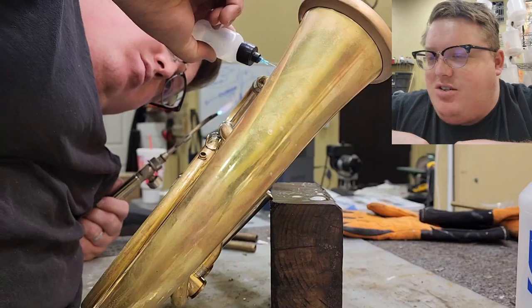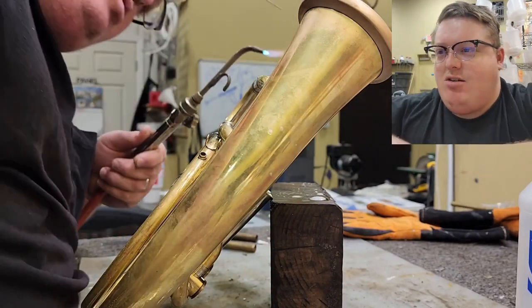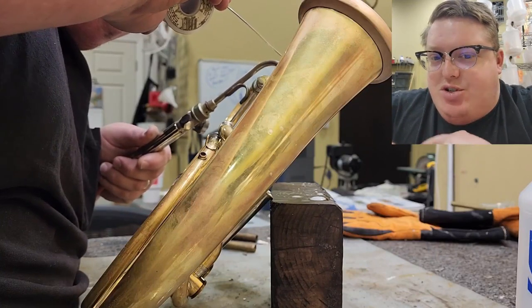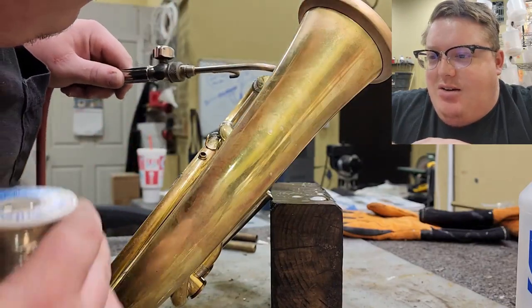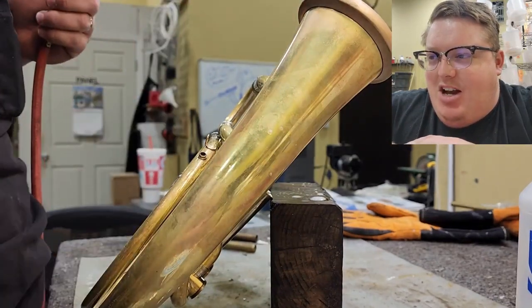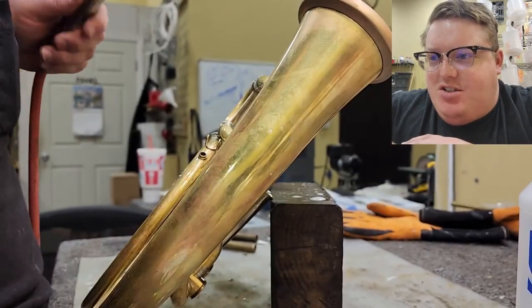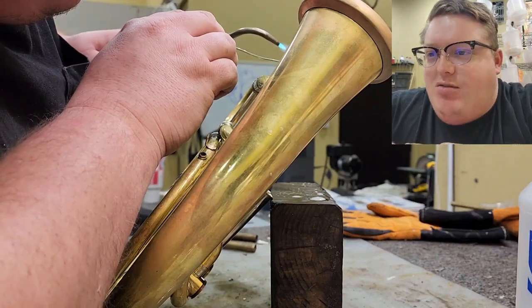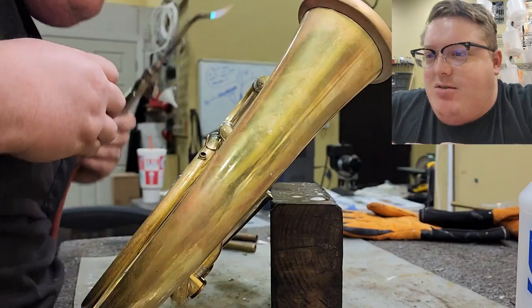A little bit of flux on the surface to make it nice, smooth and shiny. Adding flux to a solder joint after you have already finished it will smooth out the surface, because sometimes when solder cools it will have kind of a crystalline look to it that's difficult to get a shine from. But if you add flux to the surface of it and remelt just the surface with careful heat control, you can get a really fine solder surface that way.